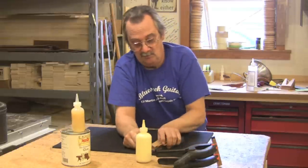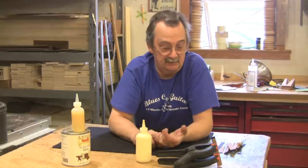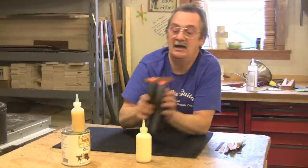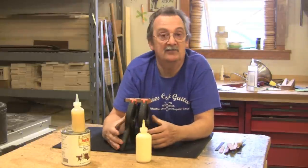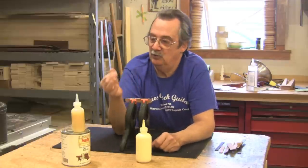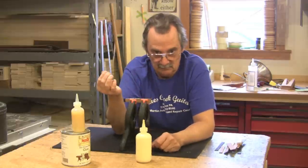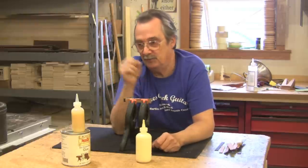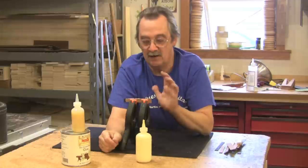My favorite term for saying about gluing, especially when we're doing clamp or top bracing, back bracing, whatever, you let the glue sit, and after about 5 or 10 minutes, and I can guarantee you the guys are going to know exactly what I'm talking about, that glue will boogify, and it will come up, and it will literally come off in a nice, clean piece. It will just come off like a rubber band, and you can roll it between your fingers and flick it in the trash. You'll understand exactly what I mean by boogify.